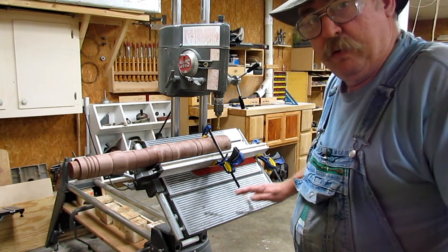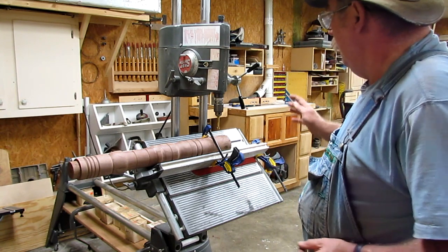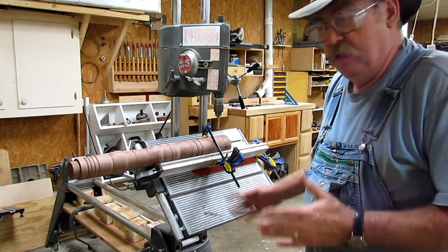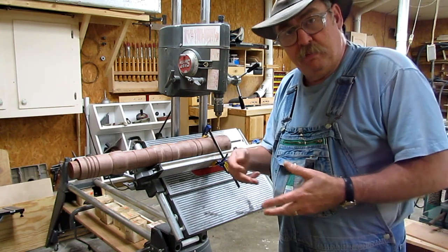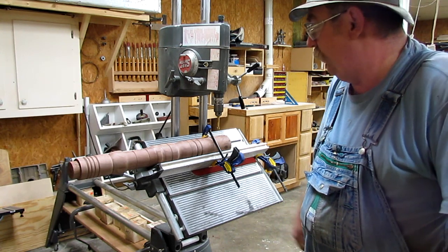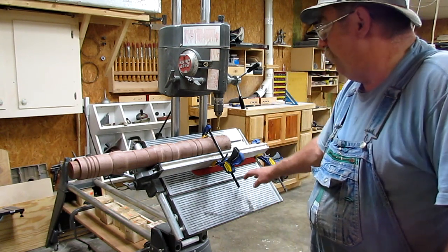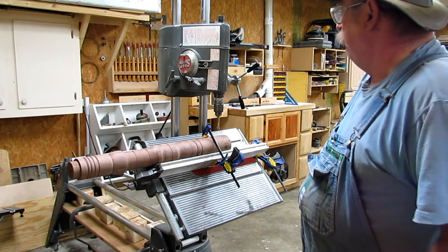And maybe I've got a 3/4 dado head set up on the dado saw. So I might set up a 1/4 inch dado cutter in this Shopsmith and have this to use to cut the grooves in my drawer sides and back and front for the plywood for making drawers. Once in a while I'll do that. It works really good for that. But beyond that, I don't ever use the table saw function of it much because I've got a big table saw. If you're cutting very big stock, the table saw is not very good because the table ain't that big.